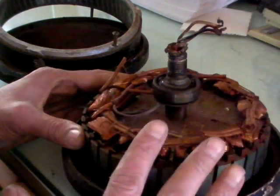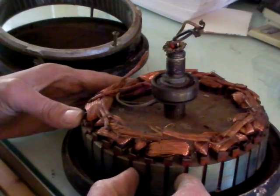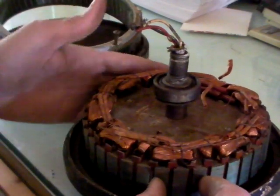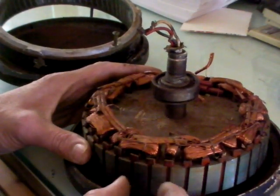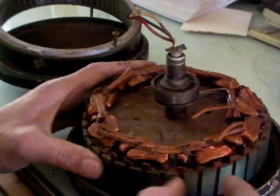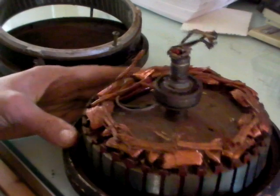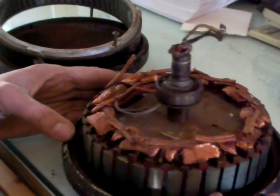I've been searching the internet — I had a 30-slot one and it was not recommended versus a 36-slot. Because eventually this is going to be a three-phase generator, so for every three slots you'll have a magnet, north-south, north-south, and so on. For every three coils we'll have one magnet.